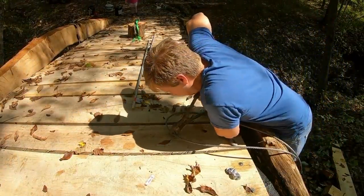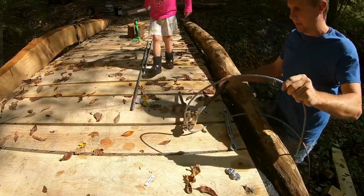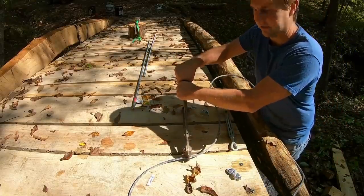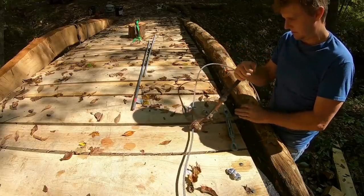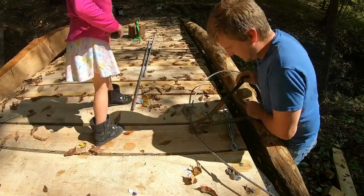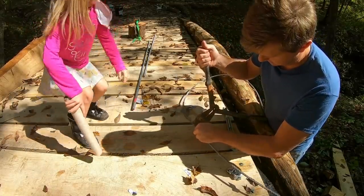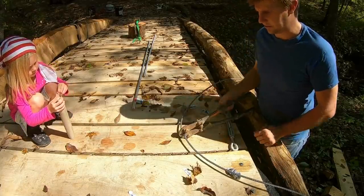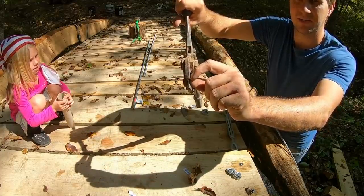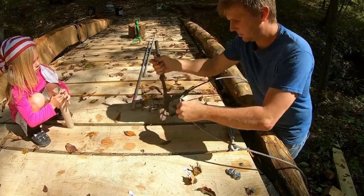That's why they make things go. Cable cutters. But I have a hard time buying one tool for one occasion. It's not on. It's too hot. There we go. YouTube jokes. Because it was all dark. Yeah, they're not made for cutting cable. Oh, but we cut a few strands. The thing about cable cutters is the bypass, so you get all the strands. A bolt cutter is just designed to put enough pressure on there, and the bolt normally doesn't get cut. It puts enough pressure that it splits the bolt and breaks it. It's not really made for cutting cable, but by golly, we're getting close, aren't we?